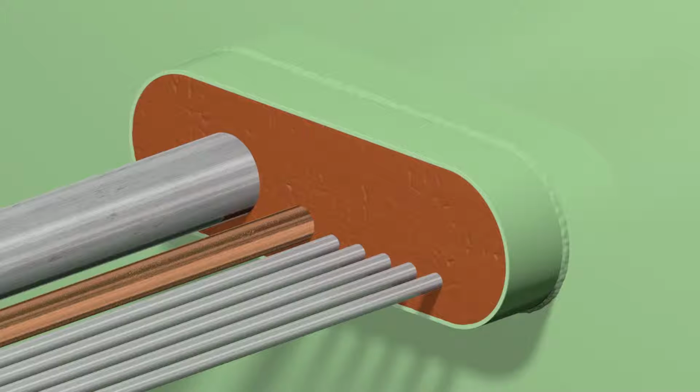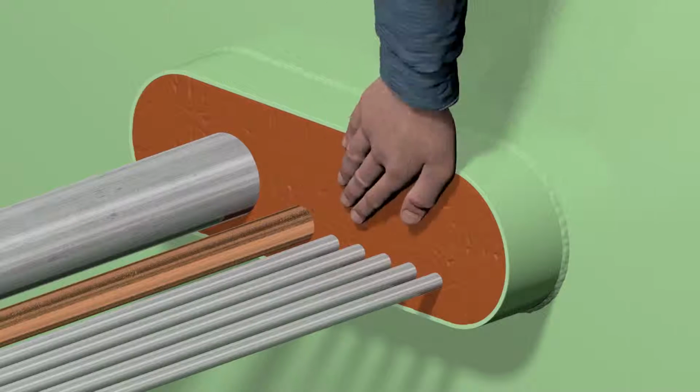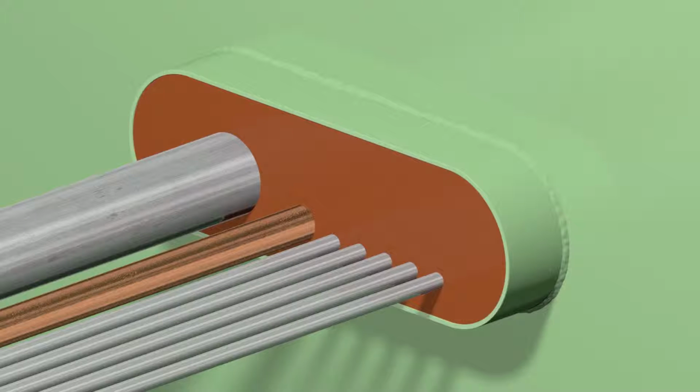The final surface can be smoothed by hand. Just wet the hands thoroughly with soap and water. No dirty hands when working with NOFIRNO, and a very neat surface is the result. Soap should only be used in this final stage and only for smoothing the surface. In all earlier stages of the installation, the use of soap must be avoided.